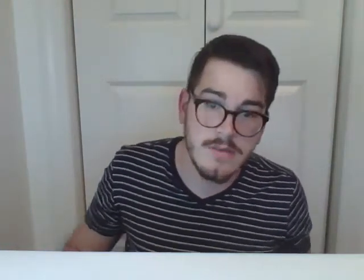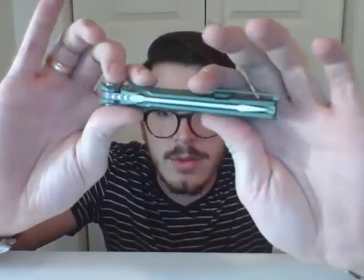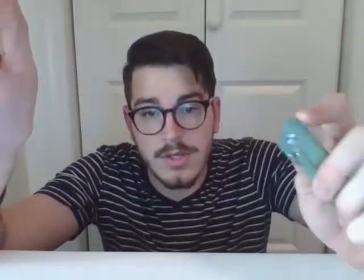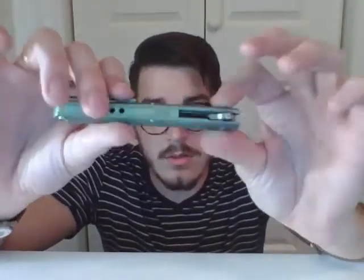I like this knife — it's a good knife — but there were some seriously bad things when I first got it. This came in the mail from the dealer and a screw backed out on its own just from the flipping action while trying to break it in. The centering was off, the action started degrading, and I had to apply loctite — there was no loctite in it. I opened up the knife to get familiar with the internals and there was rust inside on the steel races that the bearings sit on.